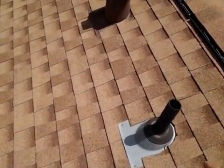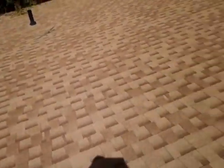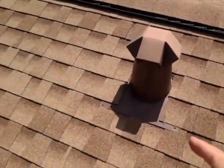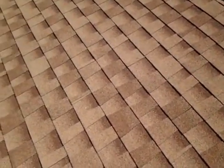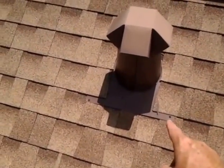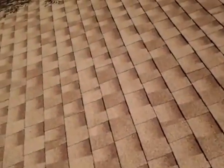Your pipe vents are looking good. The gaskets around them look good. You've got a couple of roof vents here — usually these are for ventilation from one of the other systems. These nails still do need to be covered up with caulk.